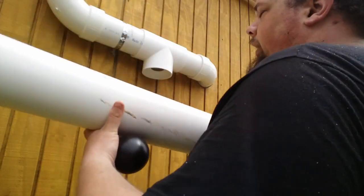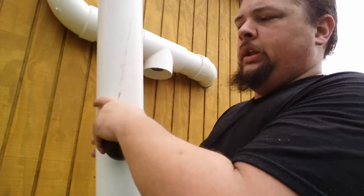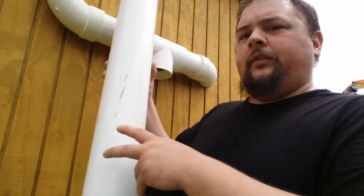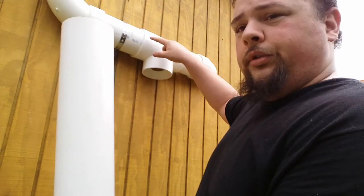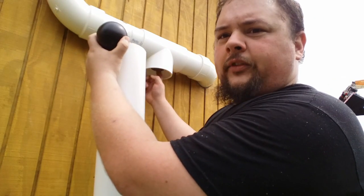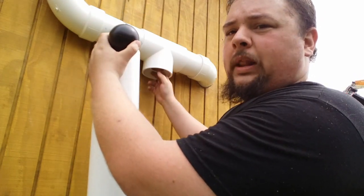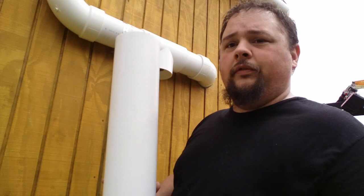This is the bottom section, so it's actually going to go upside down like that. As this fills up with water from the first flush — the first half inch or so of rain — it's going to slowly leak out of the bottom. That's how it drains, but not so fast that the clean water comes out through it. The clean water is going to go through the T. Once this gets full, the ball is going to float all the way up to the top and block everything in this tube using that little insert inside the T. All the clean water is going to pass through the T and into the tank. That's how a first flush diverter works — it keeps all the gunk off my roof from going into my tank.